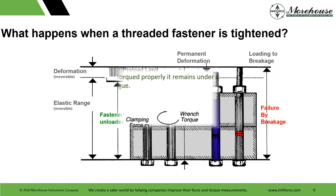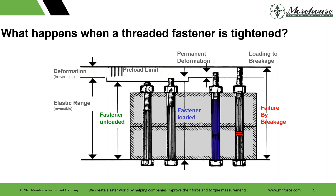If we get everything right, we're going to be within this zone — where we have not deformed anything. We're going to load our fastener, hopefully to the proper range and not exceed it. But if we exceed it — maybe we do an extra click on a wrench, get 10% over — as long as we're in that elastic range, it's reversible. If we overclick and apply 30–40% more, we might get permanent deformation of the fastener and may not know we've done it. And if we go too far, we get failure or breakage.